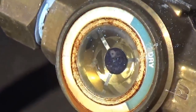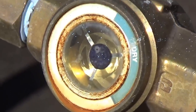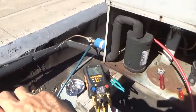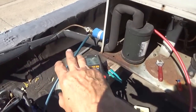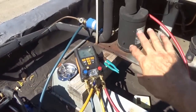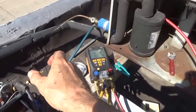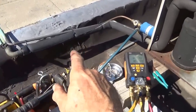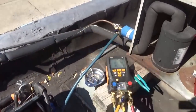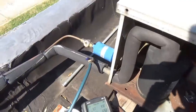What happened was the sight glass filled up. The expansion valve, when the case was warm, opened wide open and was spraying a lot of liquid refrigerant into the evaporator coil and coming back. Then as the evaporator got cold, the sensing bulb on the outlet of the evaporator on the suction line got cold and it closed the expansion valve off. The valve closed off and the liquid backed up. So I don't have a problem with being low on gas.